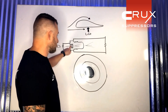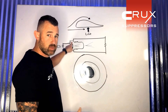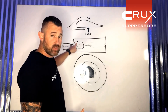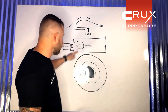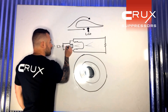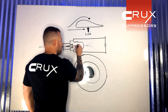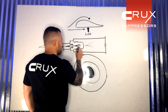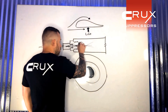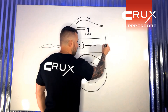This tolerance is then married up with the tolerance of the threading of the brake or the suppressor mount. The suppressor mount has a tolerance of how it attaches a suppressor. So if you're talking about dead center — you've got your centerline, you've got your first tolerance angle, then you've got the next one that's wider because the tolerances are adding to one another. You have a wider angle, and by the time the bullet goes out the can, it is seeing a wider tolerance angle of those machined features.